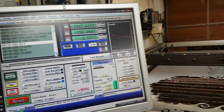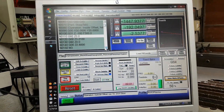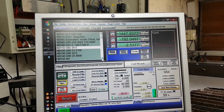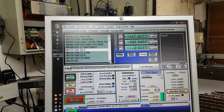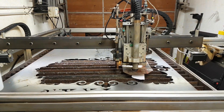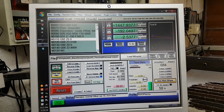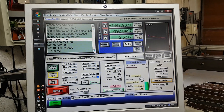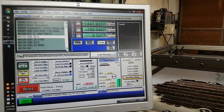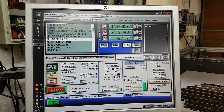If you're cutting plasma, you want around 3.4 to 3.8 millimeters starting height for your first cut to pierce the hole. Then Mach will tell the machine to drive down to 1.5 millimeters, assuming you're cutting 3 millimeter steel like what I have on the table, giving you a consistent cut height of 1.5 millimeters. Once it's finished cutting, the torch head drives back up, goes to the next location, and the whole offset process starts all over again.